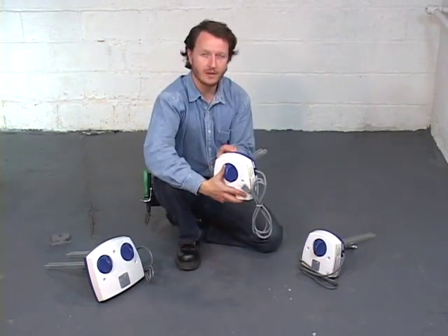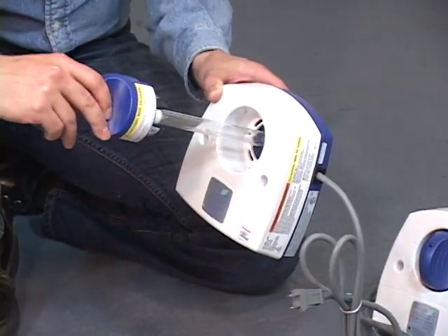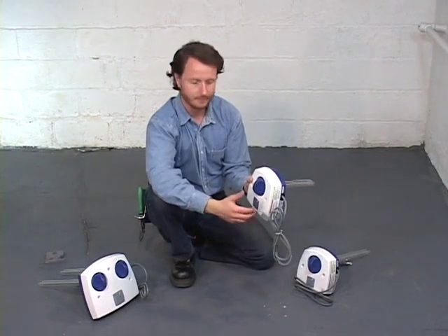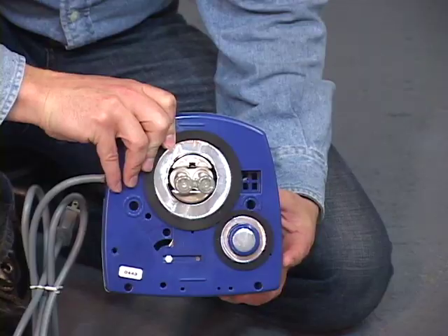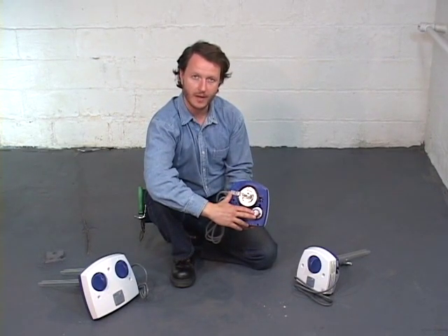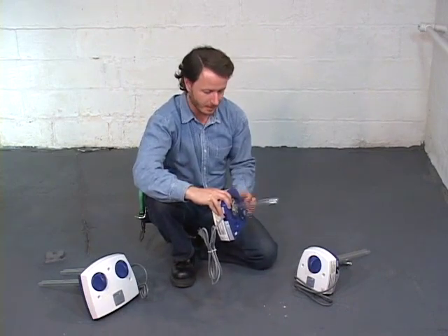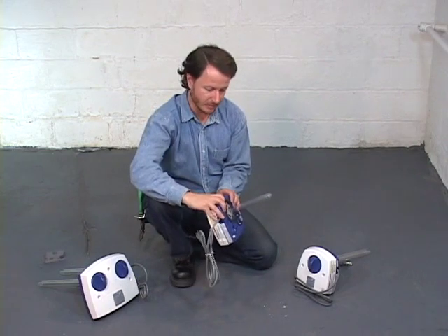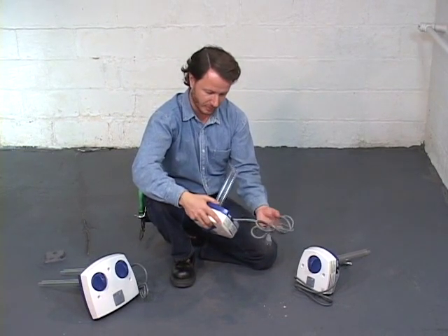What type of assembly work needs to be done? Very little — basically you just have to put the light bulb in. The bulb comes out and you simply insert it into the base unit and turn it clockwise. You should hear it click into place and then you know it's done. On the back of the unit there's an air flow sensor. The air flow sensor senses air moving through the return air duct and allows the unit to come on only when air is flowing — that's for safety, since ultraviolet light could be dangerous to look at. It also means the bulb only runs when necessary, saving energy and bulb life. The unit simply plugs into 120 volts.